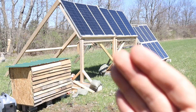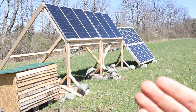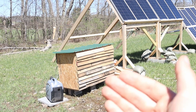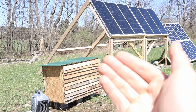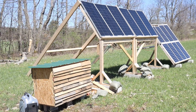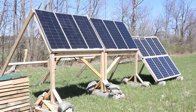If I got a couple of cloudy days, the 800 watts still just wasn't enough — but now that I have two kilowatts I've had no problems. If anything, I've been generating too much power and the battery bank gets too full; I actually need to come out and disconnect the solar panels. I could really use a dump load so when the battery bank hits maximum capacity something sucks up all that excess electricity, but all the components for that cost hundreds of dollars, so I'm trying to think of a cheaper way.